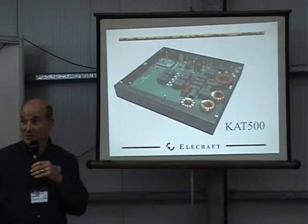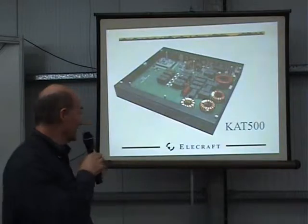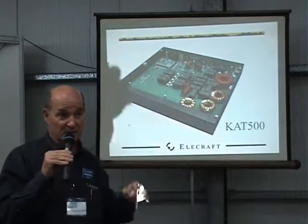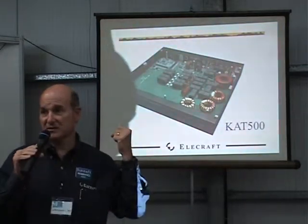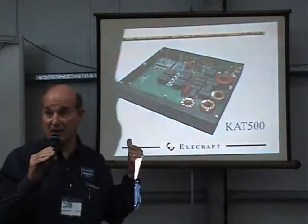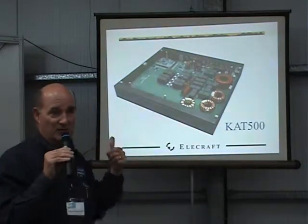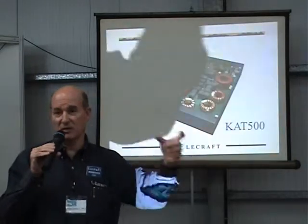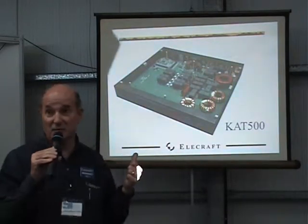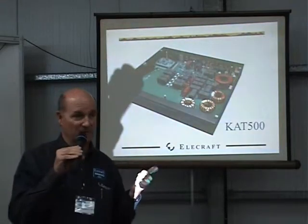One key thing with the amplifier is, of course, you want to make it seamless and automatic, but you can't do that without a smart auto tuner. So the next thing we did this last year or two was to bring up the same tuner we use in the K3 and all the other radios, the same L networks, the same exact algorithm from software, just scaled up to high power. I mentioned this will handle a 500 watt level at 10 to 1 SWR on 80 through 10. We derated at 5 to 1, either because of strays, capacitance up at 6 meters, or high voltages down at 160. And then, actually, we don't officially tell people this, but that's equivalent to the same voltages and currents at a 3 to 1 SWR at about 1500 watts.